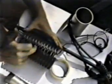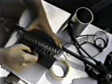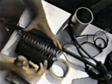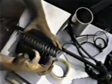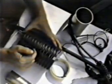My first attempts with the plates, I hooked up negative this end, positive that end, and hoped it would flow through. We got a very, very minimum amount of gas coming off the inside face of negative only. None of the other plates, not even positive, was producing. Then I took from negative here and went across to the end one, so that was positive, negative. That becomes one unit, two plates. It produced gas on the inside of there tremendously. None of these produced. Still similar fine mesh bubbling on this one because we still have negative to it.